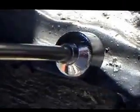And again, you can see right here they filled it with silicone, but you definitely got rust jacking inside that. That has to be addressed. It's affecting the whole connection. The rivets are popping. They've put bolts. Definitely needs to be addressed. Okay.